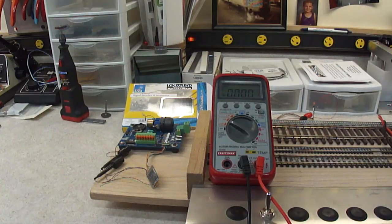You can do the same thing using a speed table. It's important to note it's just more CVs to set. I've done it off a three-point curve using CV2, CV5, and CV6. A speed table uses CVs 67 through 94. You use the exact same process: start at CV94, set it at the same values used here — start at 153, measure the voltage, and work your way through it. Then go back and set CV67, which is the low voltage, and make whatever curve you want out of the rest of it.